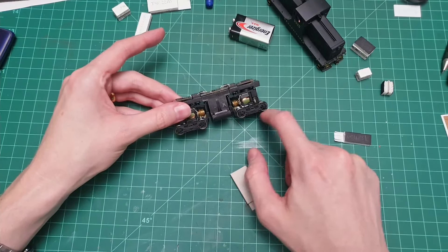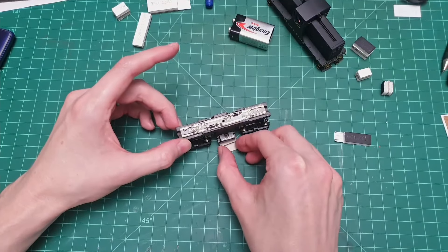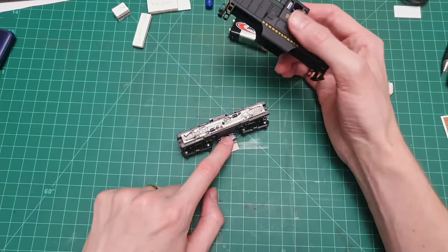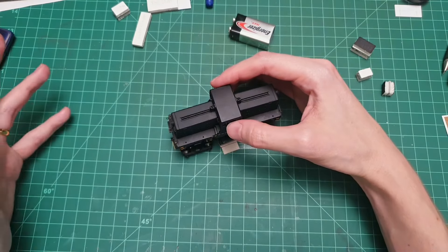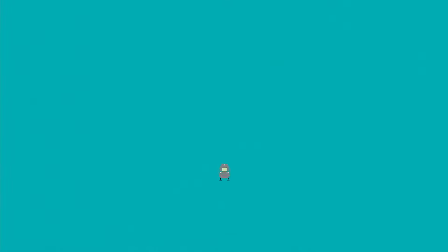Before I do anything I took a lot of measurements, including the height of the lights. And very importantly — since we're going to be chopping this off — we need to know where the height is at the bottom of the tank relative to the rails, the workbench, relative to something. So I made this little block that fits exactly underneath so everything will be measured out nicely. Why is this important? Because the tank connects to the shell, the shell connects to the coupler, and the coupler should be at a set height to couple with the other couplers. So it is important that we get this height correct.